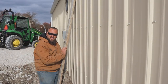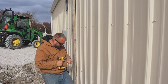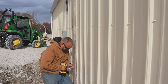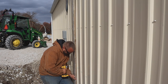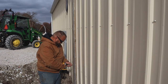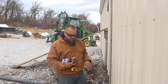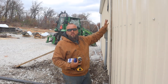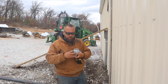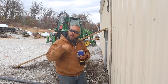Everywhere there's a screw here is supported behind it by 2x6s, so we can screw right next to those and it should be pretty solid. This gives me more area to anchor the pole to and spaces it off the ribs. My plan has been to anchor the pipe to the wall more than in the ground. I was using wood screws to bolt this on, but I realized the gutter hangs out farther — I actually need 4 inches out, not just an inch and a half. So I'm switching over to larger lag bolts and I'm going to lag bolt this 2x to the wall, then lag bolt another 2x to it.